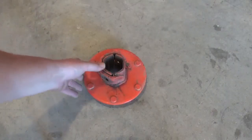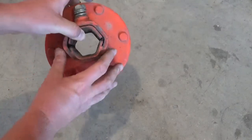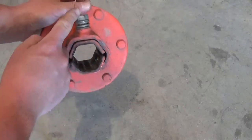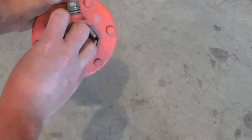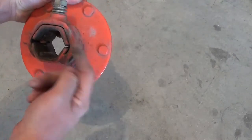Okay, so this bolt here, as you tighten it down, it's welded on the bottom half of this piece. So as you tighten it down here, it presses this half down in, shrinking up on the axle. That little rinky bolt was just going through. There's a hole in the axle. I don't know if that's supposed to be a fail-safe to keep the wheel from coming off if that loosens up or what, but the other side doesn't have one.